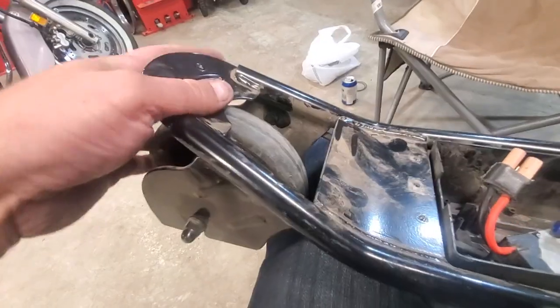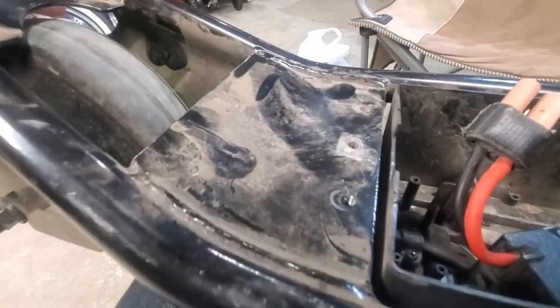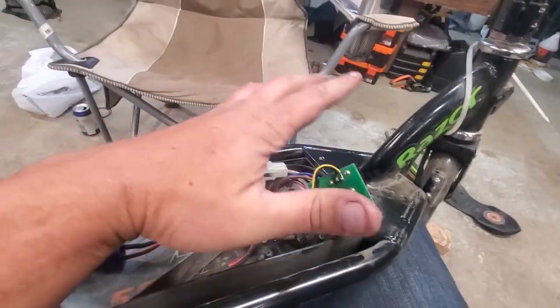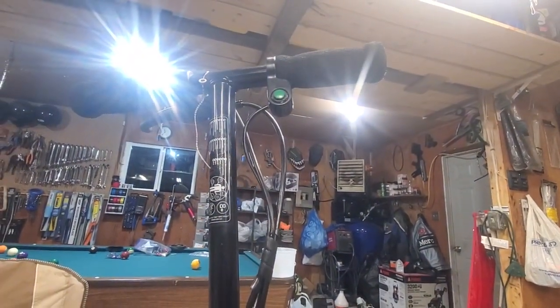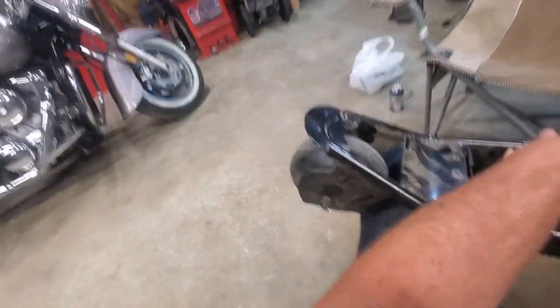The reason for that is a motor also works as a generator. So we did a little bit of hot wiring. Keep in mind, you are going to be bypassing everything on this circuit board that controls the minimum voltage and all of that good stuff. If you're wanting to just hot wire it so the battery gives power straight to the motor all the time, this is how you do it.